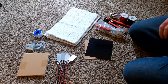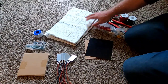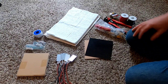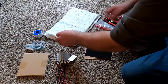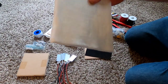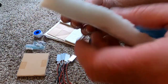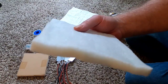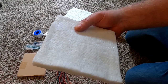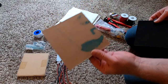The first thing I'll make comment about is this material here — this is a silica aerogel. It's an insulation that's hydrophobic, 10 millimeters thick, and I got a sheet of 9 by 14 of it. I've already cut out a 6-inch square piece. It's a really soft material, kind of flimsy — it has no rigidity to it — but the insulative value of this is unmatched compared to any other material I could find.